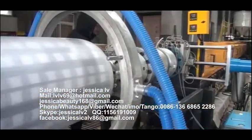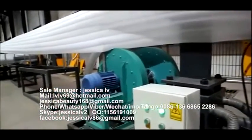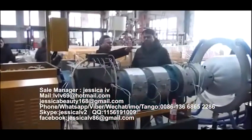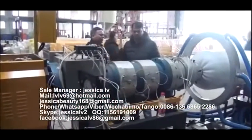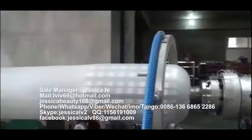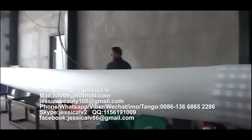After cooling by the screw tube, the plasticized blend materials will extrude out from the nose. After the product reaches the length the customer requires, the meter counter will alarm automatically, and then change the row, weigh, pack, and send to warehouse.